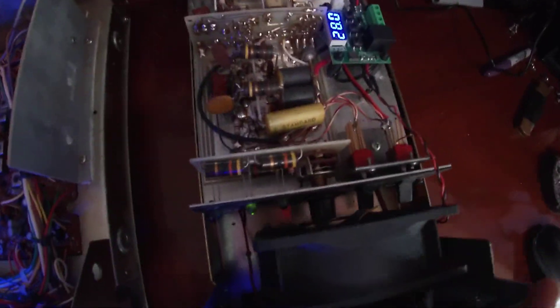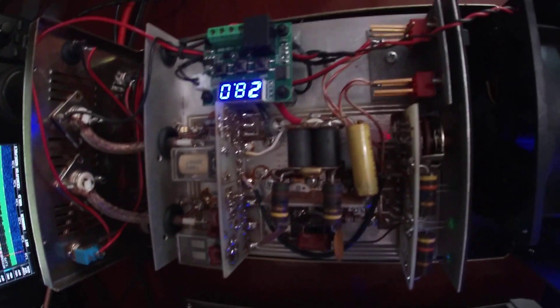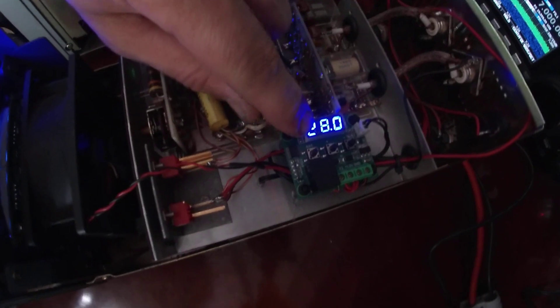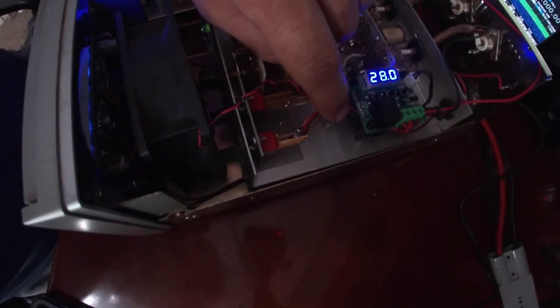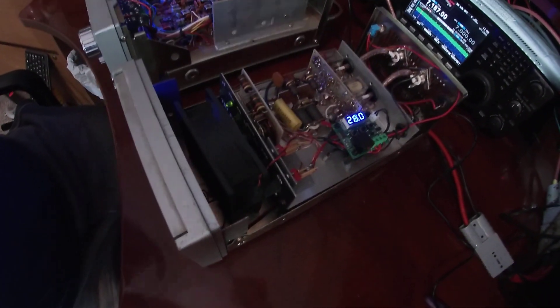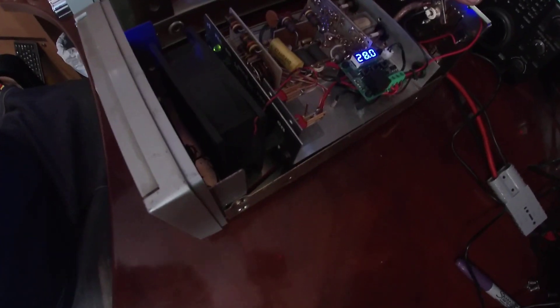What else we got in here is our little two-pill with Motorola 454s. And what we have here is a thermal switch — this is your sensor that's sunk into the heat sink. So when the amp gets hot, this fan right here blows cool air across it; it draws through the front of the speaker and right out the back.